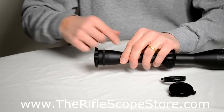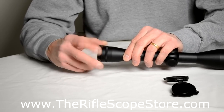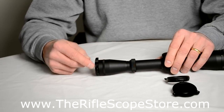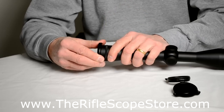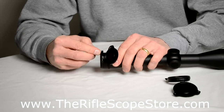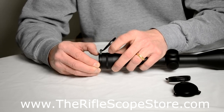If you don't focus the eyepiece first, you're going to end up messing up your focus when you go to put the flip-up cover on. Go ahead and tighten it up, and if by some miracle it's straight up and down when you first put it on, you're golden — but that generally doesn't happen. When you have it pretty tightened up, just loosen it a little, open it up, and then grab the knurled inner bearing to independently turn the rest of the assembly.